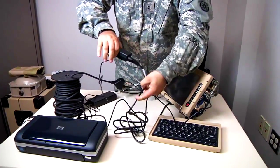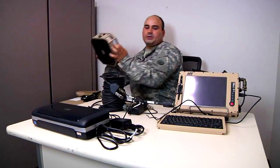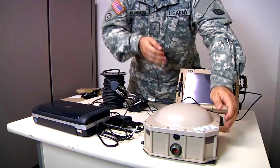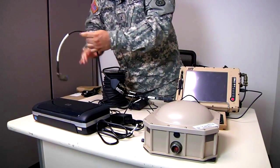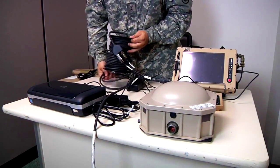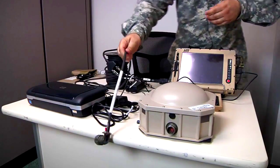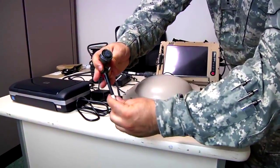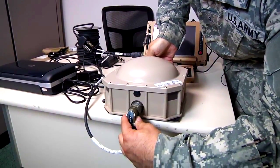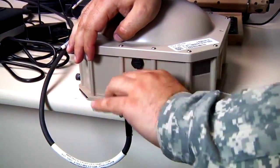We will not apply power until we are ready to apply power to the transceiver also. The transceiver needs to be placed outside and it has to have a clear view of the sky to the southern hemisphere in order to have direct connection to the satellite ITV network, which is the in-transit visibility network. This connector here will be 90 degrees facing south of the transceiver itself.